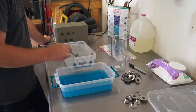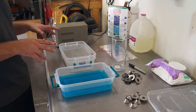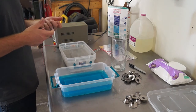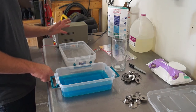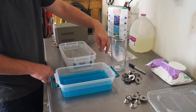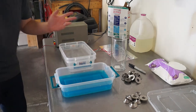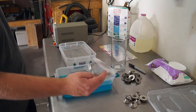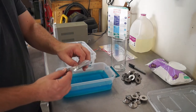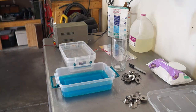Now let's talk about the positive and negative leads and how they work. With titanium anodizing, you want to have a piece of titanium as your ground. In this case, I did buy a starter kit that has a plate on the bottom. I trimmed off a piece of the plate and connected it so I could use a ground clamp on it. You don't have to do this — you can use wire. There are companies selling heavy-duty gauge wire that you could coil up and put on the bottom. The idea is to have a larger ground than your positive.